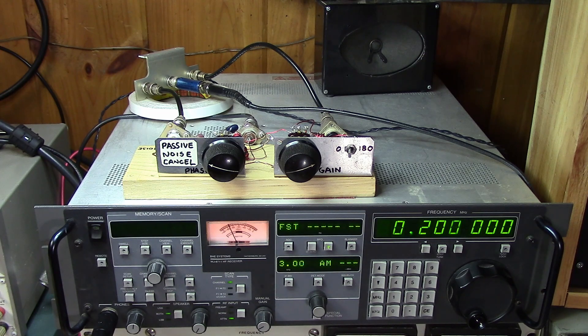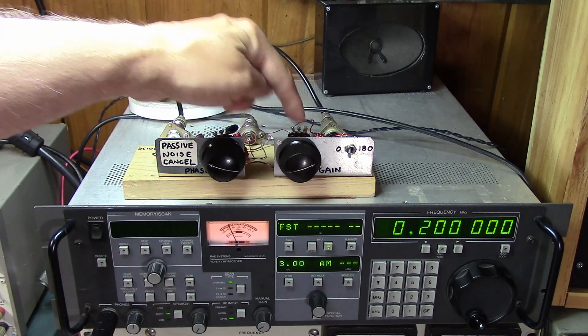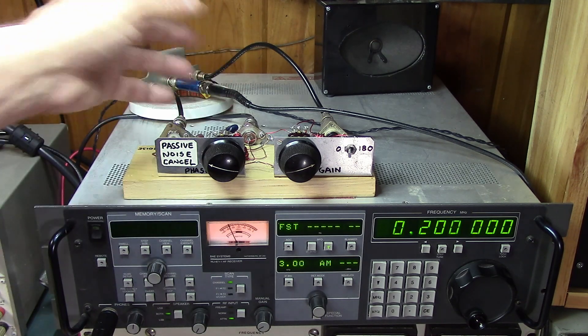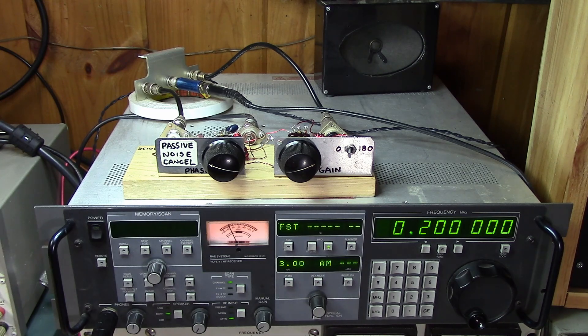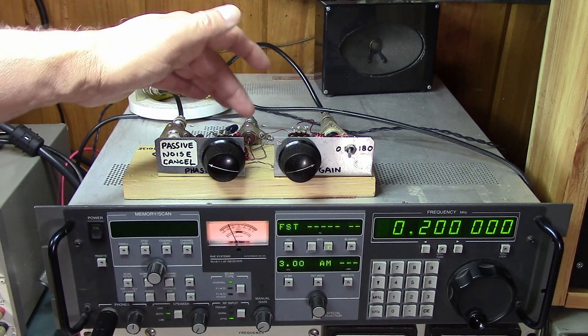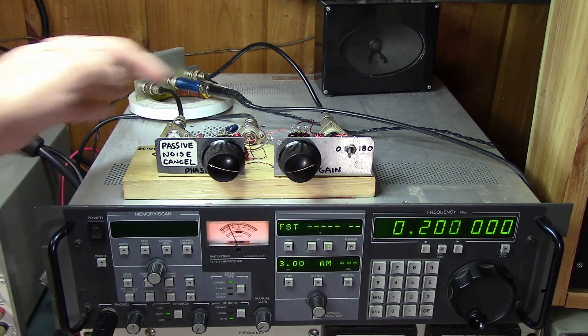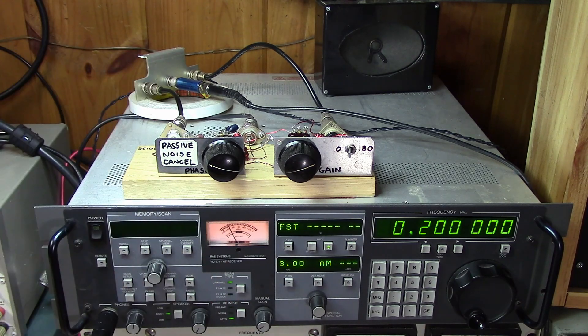Also, this is a hybrid, but of course it's not properly terminated, so who knows what the impedance is exactly. The impedance is somewhat controlled because we're using the low-value 1k potentiometers along with the high-value capacitors. The whole thing is a low-impedance circuit and that's helping out. The uneven capacitors on the phase shifter — having the 0.005 and the 0.05 — give you a couple of different ranges.